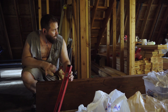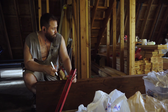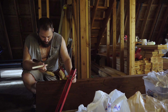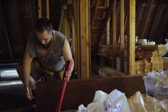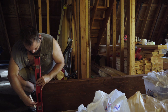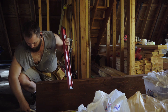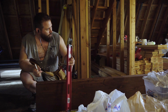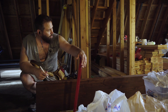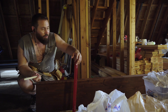I'm working on measuring this glulam out and I'm double, triple, quadruple checking it because it's $19 a foot at 18 feet. I couldn't figure it out — my measurements kept coming off. I just couldn't see it with my naked eye until I put a level in and realized it's an inch off from top to bottom. It's at an angle. Probably people who've worked with glulams a lot have experienced this all the time; I never have. I thought it'd just be really square. Just have to square that out — it's not a big deal, but it was throwing me off for a few minutes.